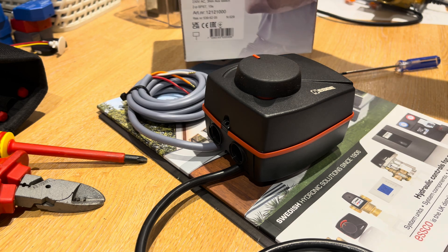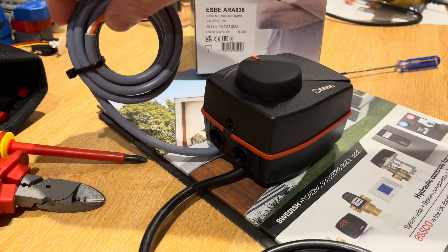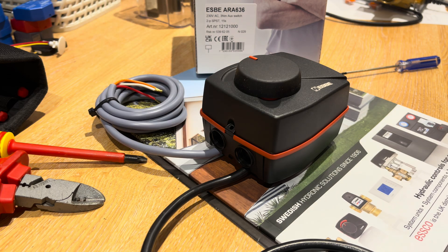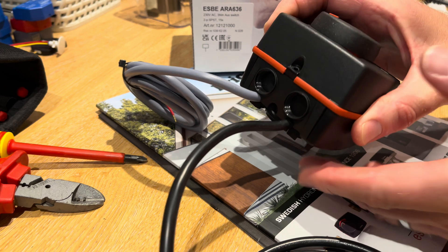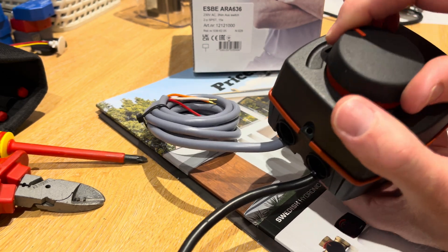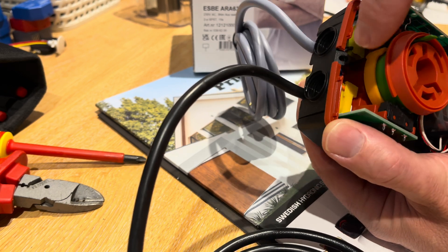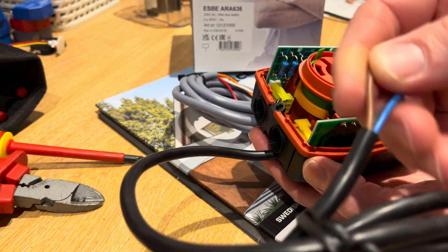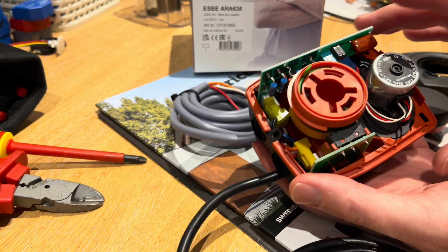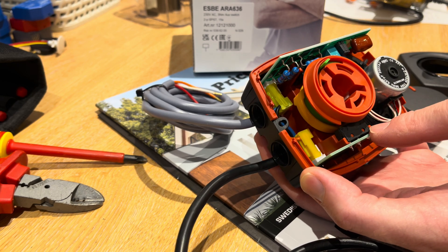Generally we use this one, which is the ARA 636, or you can use the ARA 635. The difference between the ARA 635 and the ARA 636 is simply that the 636 comes with an auxiliary lead. So if you don't want the auxiliary lead, or say the ARA 635 is out of stock, you can still buy the ARA 636 and simply remove the screw, take this off, open this up, and you can actually remove the connector on this side. If you follow this grey cable through onto the connector here, you can actually remove this cable — it is then just a live, neutral, and switch live cable on this side. So the big difference is just that the 636 comes with an auxiliary switch and an auxiliary switch lead.